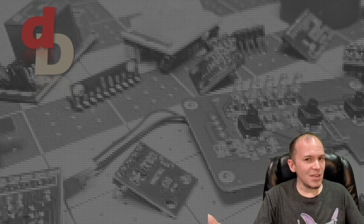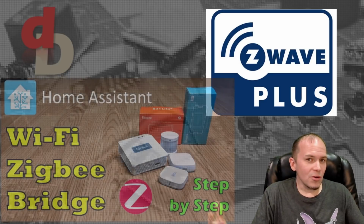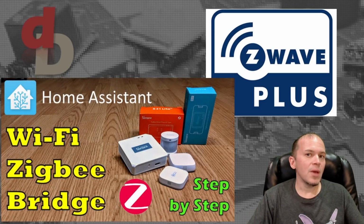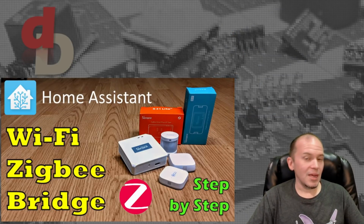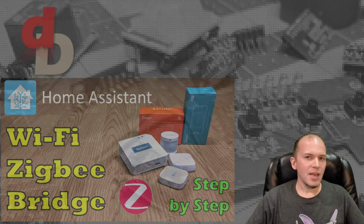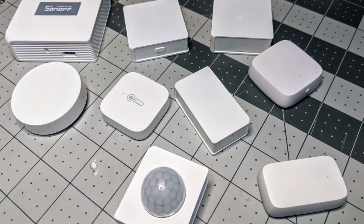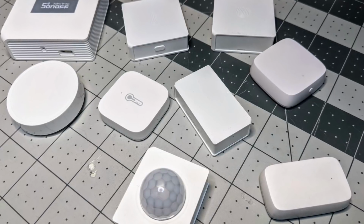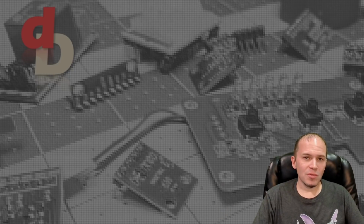So yeah, there is Z-Wave and Zigbee. You can use those switches and they won't be on your Wi-Fi, and they do come already ready to go, but they're usually a little pricier. And then you need a different hub to use them. I like to use Zigbee for battery-powered devices, because Wi-Fi and MQTT devices on batteries just suck.